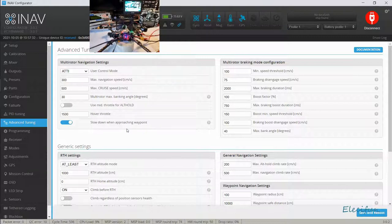And that's also something that you can use as a bit of an alarm. So if you drop it in a field somewhere and as you're getting up you can't find it, you might hear those ESCs kick in. Mine are set for 10 minutes. And then they kick in and you've got that tone, that little noise that you can hear out there in the field. You might be able to find your craft. So it can be a bit annoying, but it's there for a reason.